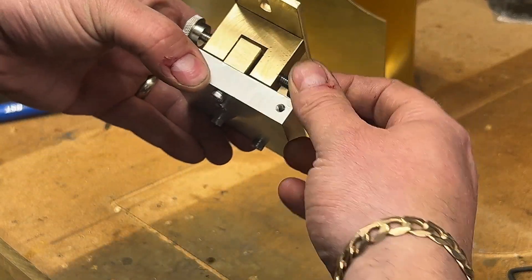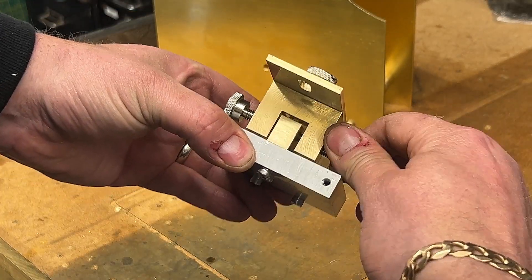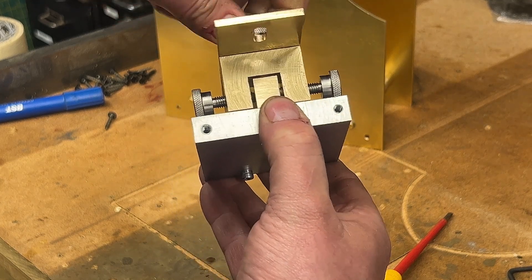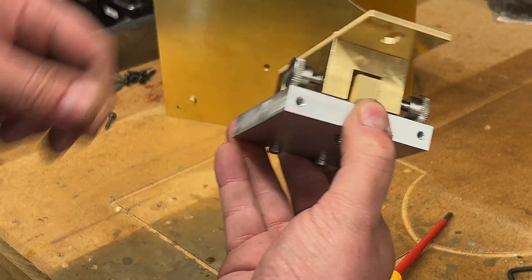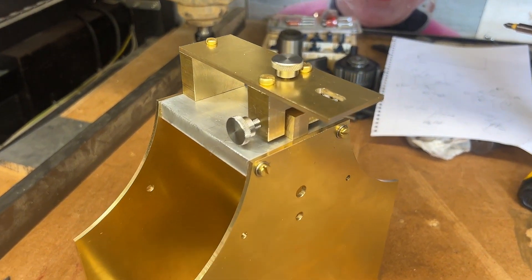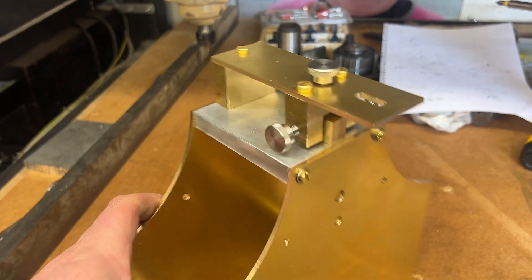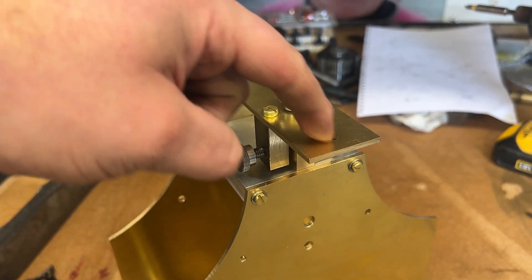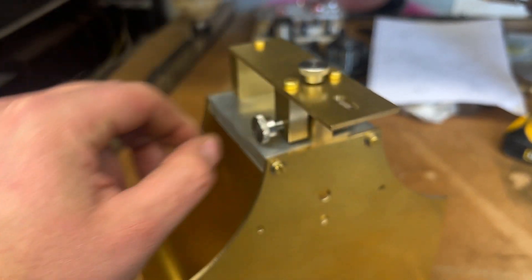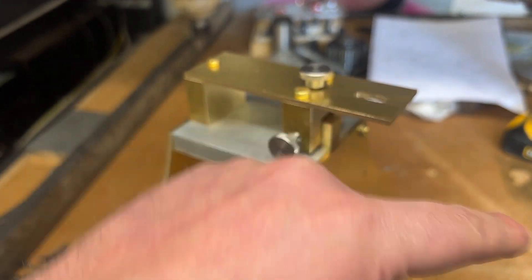That works already. I've just shifted the position because it's only on that one single back bolt. Okay, so there it is mounted to the frames. I've gone for the slot rather than the full slot all the way to the front - it needs a bit of a deburr actually - but I think it keeps a bit more rigidity. Maybe it does make a difference. I've seen pictures where it's slotted and pictures where it's slotted all the way to the end.